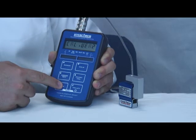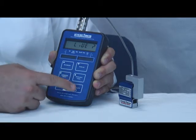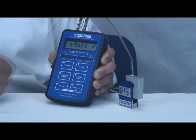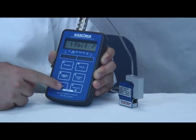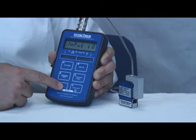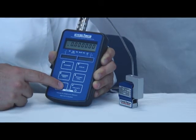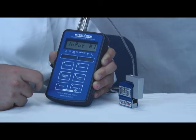Calibrate — check to confirm. Now it asks if we want to do a live calibration with applied loads or not. We don't, so we press X. Now it asks if we want to do a table calibration, where you enter a millivolt per volt value — we say yes to confirm. Now it asks for input low, which is typically going to be 0. The default is 0. Then it asks for the display low. Again, default is 0 and that's typically the correct answer, so we'll confirm that.